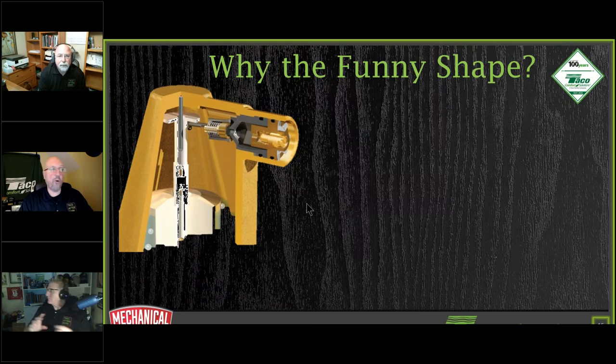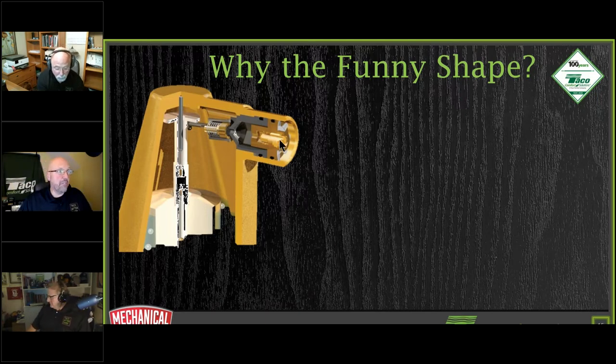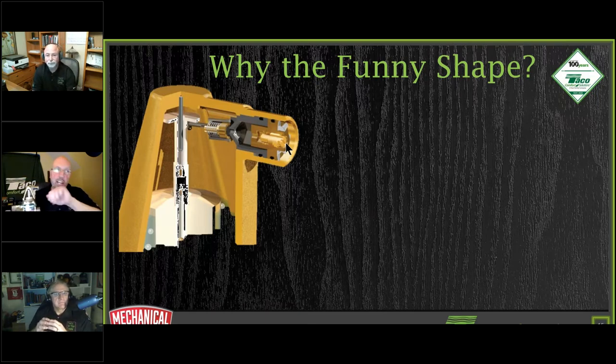There's a specific design to this. And one thing I want to point out is our vent, where we have a cap to shut it off if you don't want it to vent on its own. We have a little screw in here that you can shut down. And that's probably useful when you start purging a system on that initial purge, because then you start putting water and air through here and this thing starts bouncing up and down. And if this is anywhere near your face like this, you're getting a couple of spits in the face. All right, so I like to close it down in the beginning, in the initial purge. So you have that screw out there.